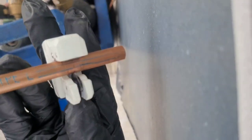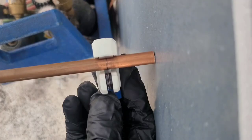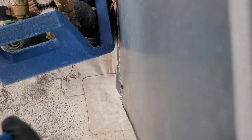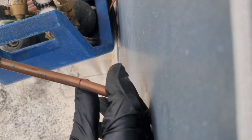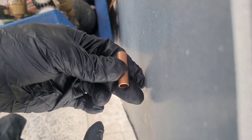You don't want to break your tool or break your blade. If you do it too tight you'll break your blade, break the tool, or mess the copper up. About a quarter each time. There it is. Now I'm going to go get my swage tool.